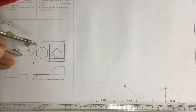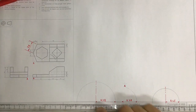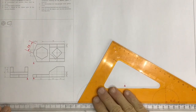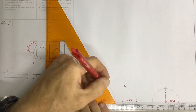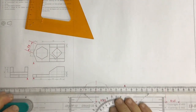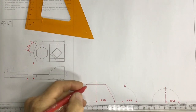We're going to take that measurement of 38, measure it off accurately, come over here, and draw an arc going round. You can see that I've got a center line going up there — that is incredibly important. Once I've got that arc in place, I can now come across here and draw with a 60-degree angle a line going up there from that intersection, and a line going up there from that intersection, and a line going across over here from the intersection of the line and that circle.